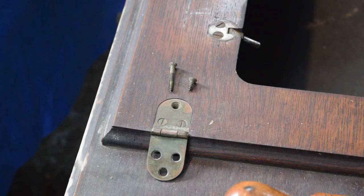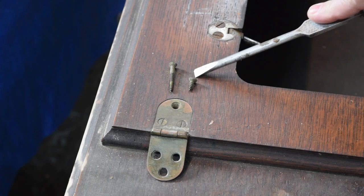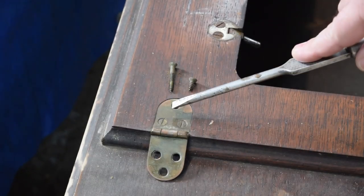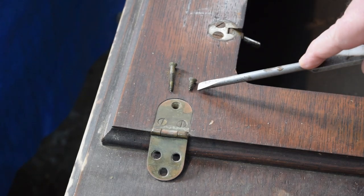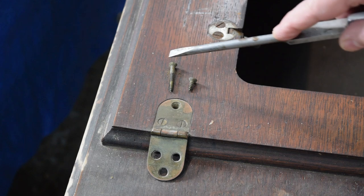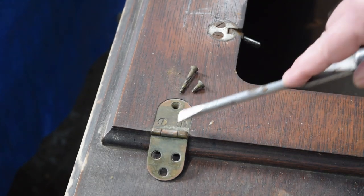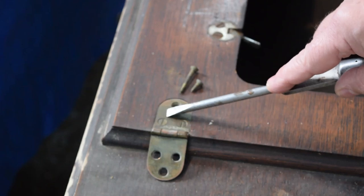And again, not to beat a dead horse, but as a reminder, these are the screws that come out of these lid hinges. The ones that come out of the machine side are very much longer than the ones that come out of the hinge side. If you mix them up during reassembly and run this screw on the lid side, you will poke through your lid and have to do your work all over again. So remember, the long ones go on the inside.